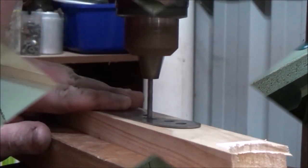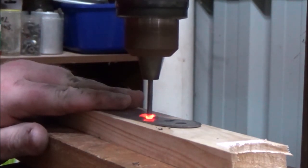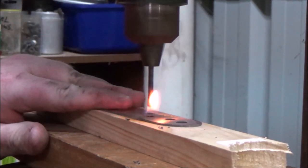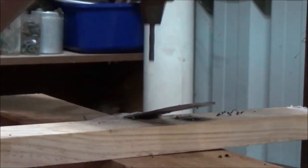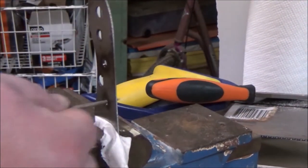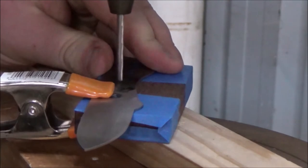Here I'm trying to drill the holes. I've got a special drill bit meant to drill through hardened steel, and that took a while. What I think happened is it superheated the wood underneath, and then when oxygen got to it, that's where the flash came from. My drill bit broke, so I had to file out the hole — which, considering how extremely hard it is to file this steel, took about 10 minutes of mucking around.